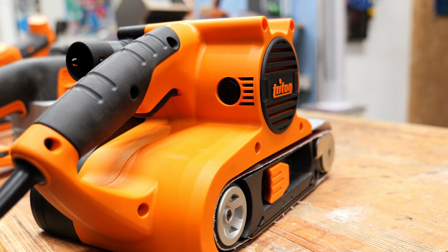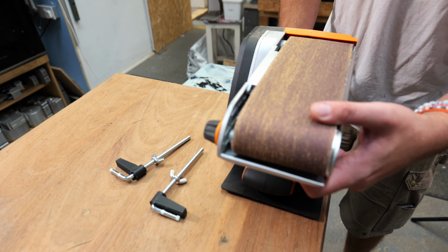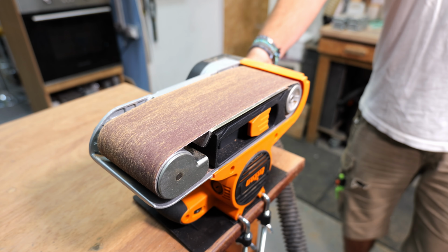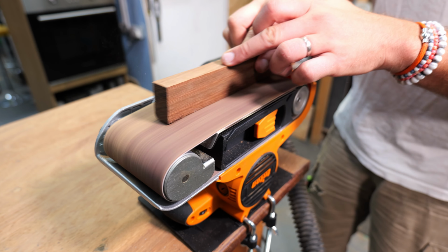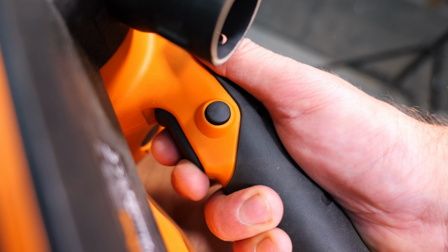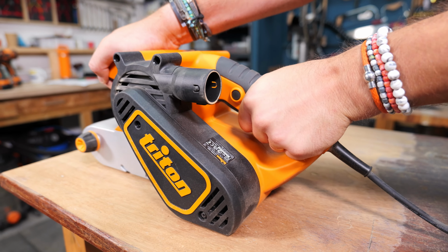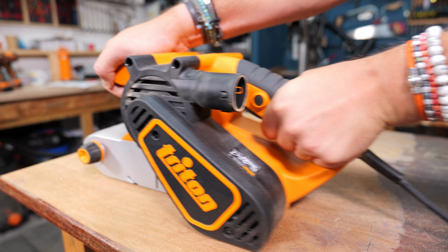As well as being able to tear through pretty much anything you put in its way, there's another feature that this tool has that makes it one of our favourite handheld sanders. The top of the unit has been cleverly designed so that when you flip it upside down, it sits completely flat on your workbench. In the box, you also have a mounting mat and some bench clamps, which means you can attach this to any table and give yourself a solid desktop sanding unit, opening up a whole world of possibilities for shaping materials. The trigger has a lock-on button, so you don't have to keep holding it when it's in benchtop mode. This can also come in handy when you're just using it as a regular sander, because you might be able to find a slightly more comfortable grip for those longer sanding tasks.